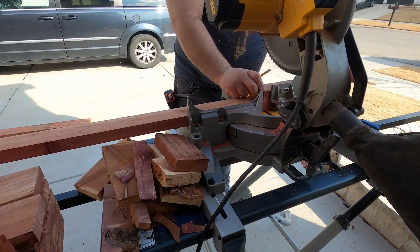You should always avoid using railroad ties. Railroad ties have been treated with something called creosote. It's nasty stuff and while it may be fine for landscaping, you definitely don't want to use it anywhere near where you're growing food. One last thing to mention on lumber: thickness counts. The thicker the lumber is, the longer it will last. All of my boards are a full inch thick, which is good. Anything thinner than three-fourths of an inch is really problematic, but go thicker if you can — say even two, three, or four inches if you can afford it.